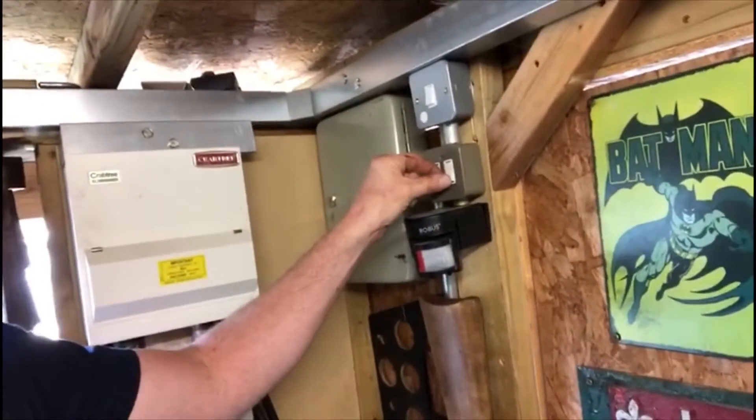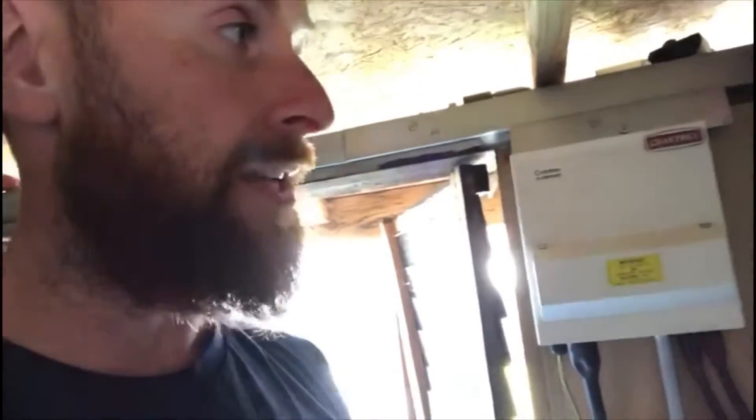The middle position is just with the lights turned off — everything is off. The PIR will still be operating because it still has a live supply, but it won't be operating the contactor.